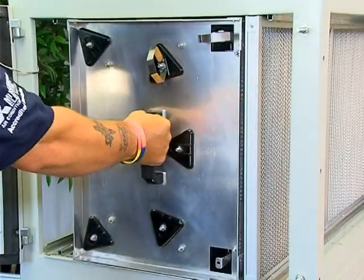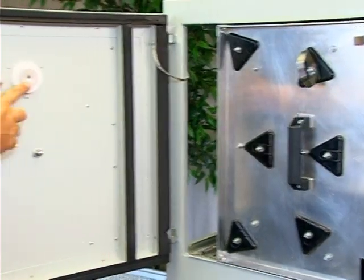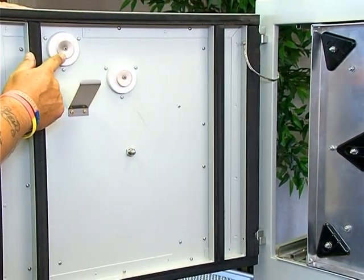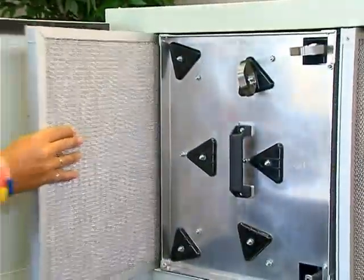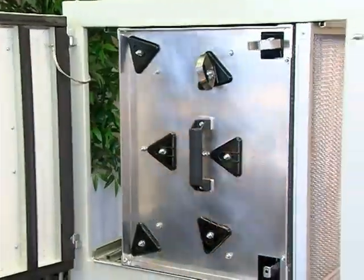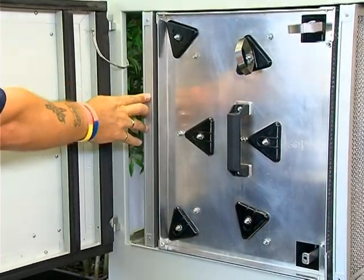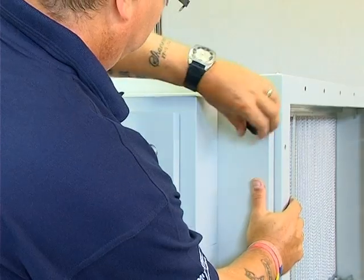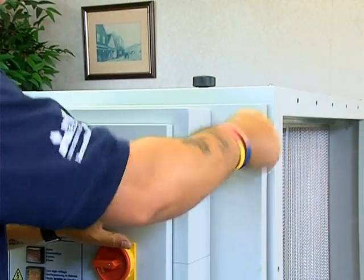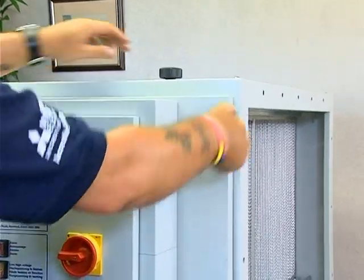Finally, when closing the door, check that the insulators and charging points are going to line up. When everything is complete, close the door and refit the star knobs to hold the door in place. Ensure that the star knobs are reasonably tight. You may need to push the door to enable the star knobs to fully tighten and make a good seal.